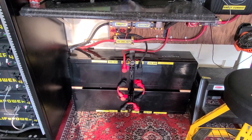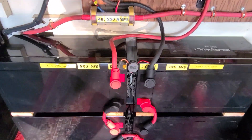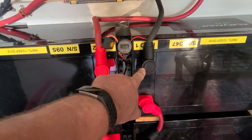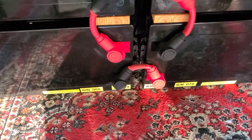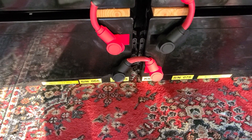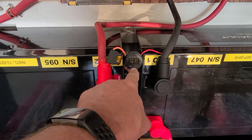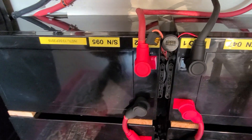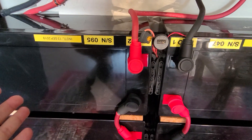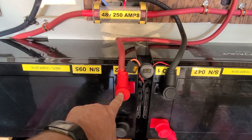For the installation I had to make some new cables. I've got silicone battery lug covers on here to prevent accidental contact — these are about $11 for a two-pack. The DC voltmeter is the one I had on there before, and the volts are within three one-hundredths of each other on the two battery banks — the EG4 and the Kilovolt system — so they're playing well together. I used 2-AWG welding cable and made new copper ends.